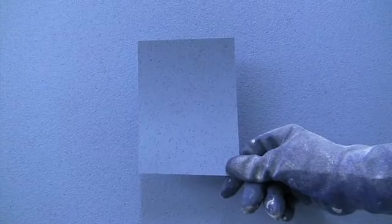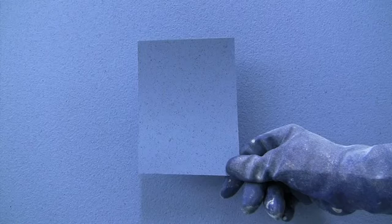Do not spray horizontal or with the crosshatch method. If you cannot reach ceiling to floor in one non-stop spray stroke, spray upper section, climb down, and spray bottom section, using a quick arcing feathering motion where the two areas join. After applying one quick pass, compare fleck density on the wall to the fleck density on the control sample. If more fleck is needed, apply one more quick pass. At this point, finish should be complete.